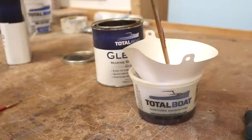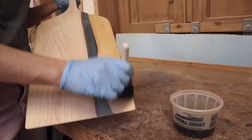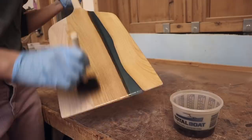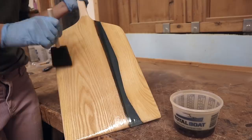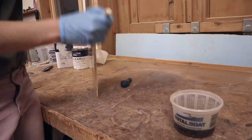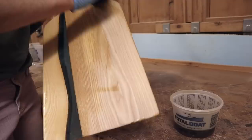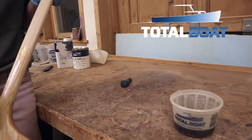Once it was fully sanded, it's time for varnish. Because the first coat is going directly onto bare wood, I do thin the varnish down a little bit — that's generally best practice, although everyone has their own way of varnishing, it's like a voodoo witch cult. I'm varnishing going all in one direction, then cross hatching it going in the other direction to make sure I'm getting every single spot, and then going back in the first direction — that's how I get my full coat of varnish. Many thanks to Total Boat for providing all the epoxy and varnish used in this video. You can use my code TOTALZYLA at checkout for 15% off all Total Boat products.